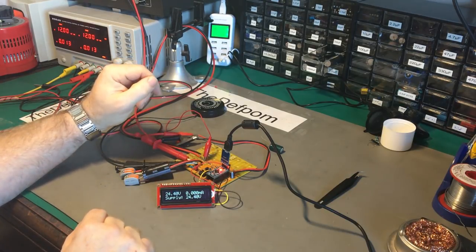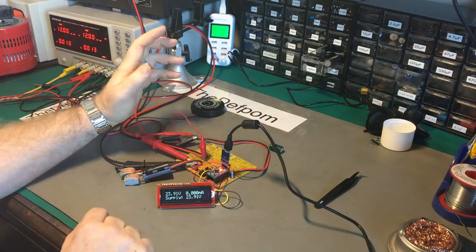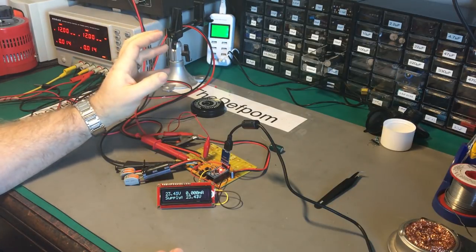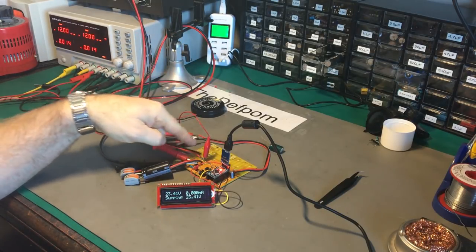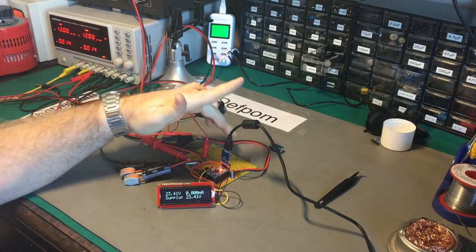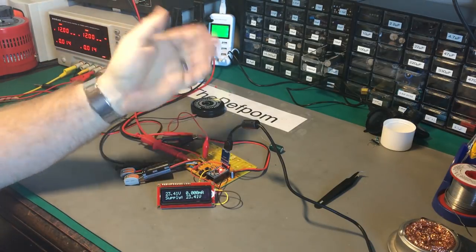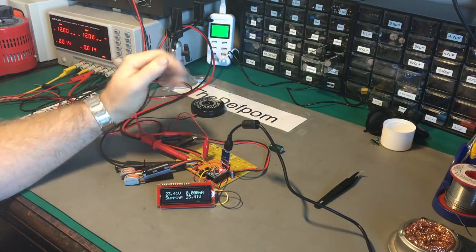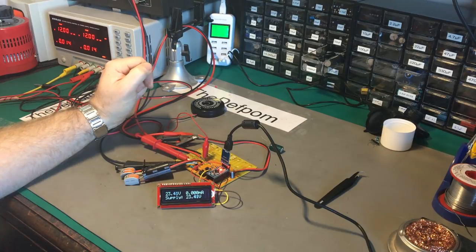This is why I need to refine the design. Once I get rid of the op-amp I'll have extra room on the circuit. I won't redesign the board until I've done the high voltage testing to determine what I'm going to use - whether a big variable resistor is adequate versus a switch and resistor array. Based on current readings I think a variable pot can handle it, so I can cut the board down. I may leave the high voltage multiplier section intact even if I don't use it, because people on 110 volt systems may need all those stages.